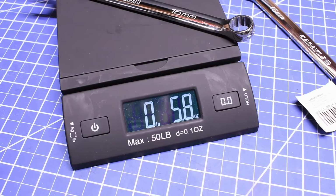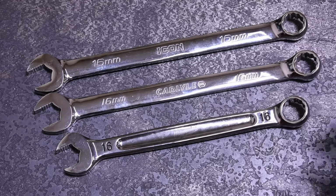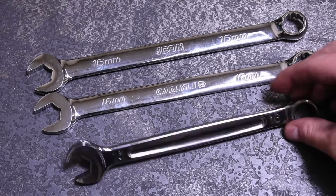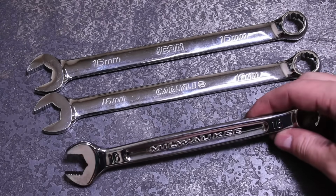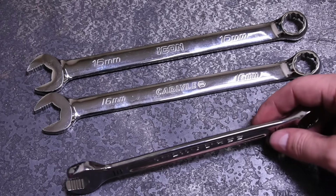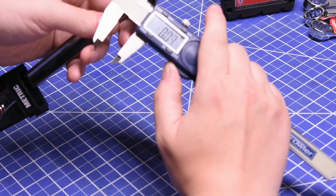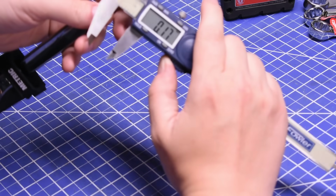The Carlyle is lighter, the later introduced Icon is heavier and thicker, and the Milwaukee, which is shorter than both of those, weighs somehow even a bit more than all of them, being thickest overall. All certainly employ the same everything-but-the-kitchen-sink non-slip design, but definitely 3 different sets of tooling and forging dies going on here. Their bolt clearances speak to that as well.